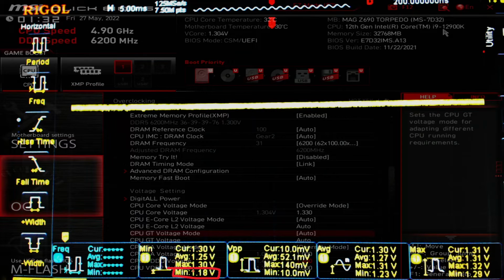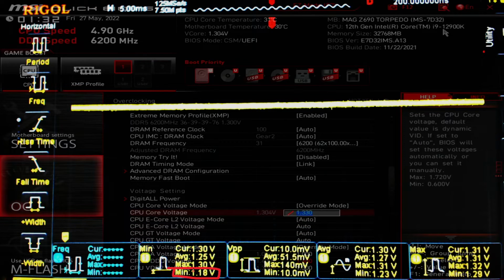It's awkward in the sense that I don't know how you'd ever test this. Well, you could. There is a test methodology that you can do. It's just very, very tedious, because you basically have to dial in an overclock within like 10 millivolts or something of being unstable, and then you can flick between the two. Actually, this would be easier to test than load line calibration.